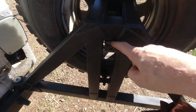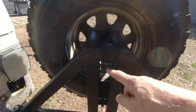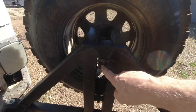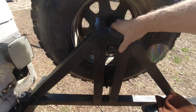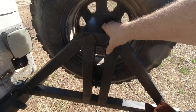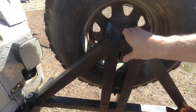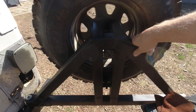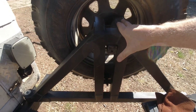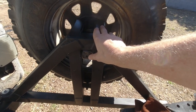Okay, so there it is welded in. For those who noticed, yes, I did weld up the cuts I made to get the bends where I wanted them — I just wasn't having luck with the bender. I did punch the hole and put the nut in, so if I need an adjustment mechanism it's in place, because it was easy to do while this was off. I don't think I'm going to use it, but it's there if I need it. The spring is just a little too stiff to push with one thumb, but my adjustment mechanism is just going to be the thickness of my rubber piece — and I've got a 3D printer and TPU filament, so I can make that any size I want.